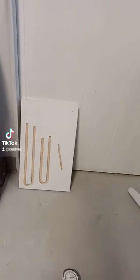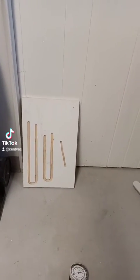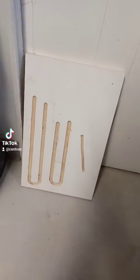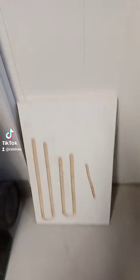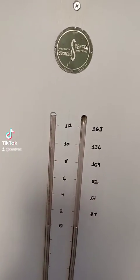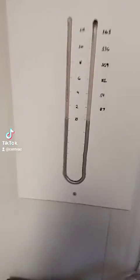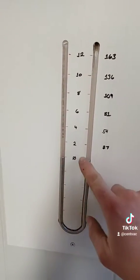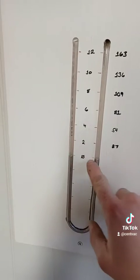Using mercury lets you make a much more compact vacuum gauge. These are my experiments trying to make a nice U-shaped channel with a router bit, and here's my finished product. Please note this is not a Spencer turbine product, but we have a U-shaped tube that sits in a channel — it's full of mercury, about half full to the zero mark.